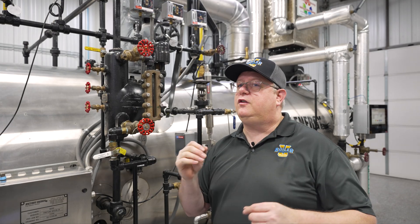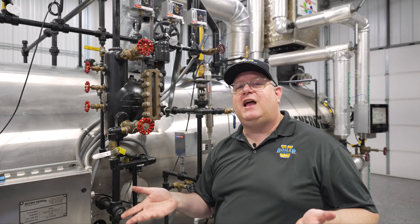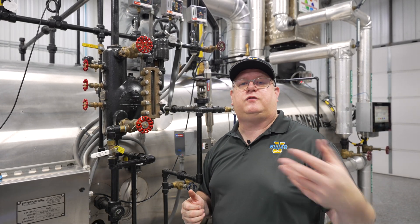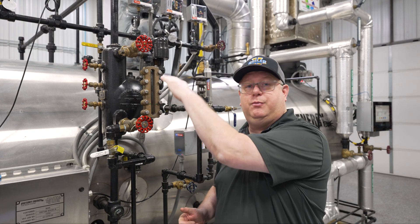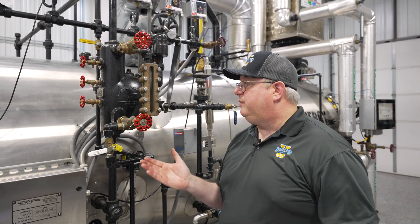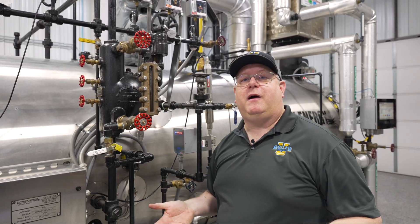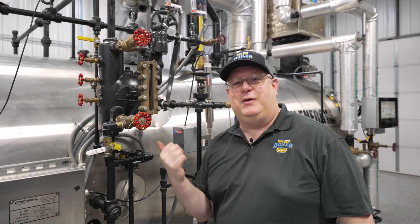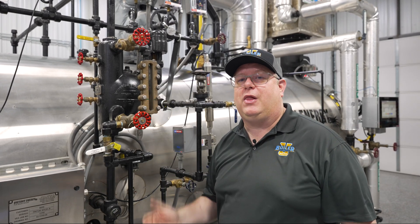So before you just order one, it's not bad to talk to your inspector. Tell them what you think of this type of sight glass, what's your experience, and if we want to put one on here, what model should we get and do we have limitations? Because these aren't cheap, and it really hurts if I change it out and the inspector comes back and says no, you've got to put the other one back — this one is non-compliant.